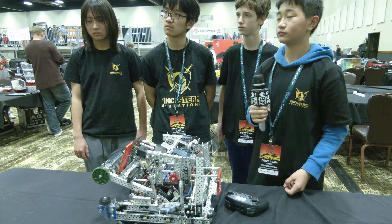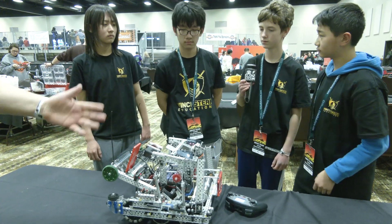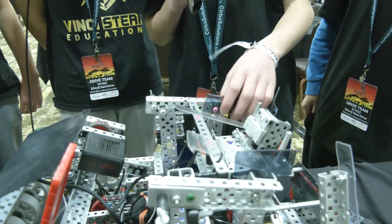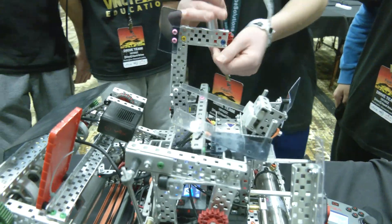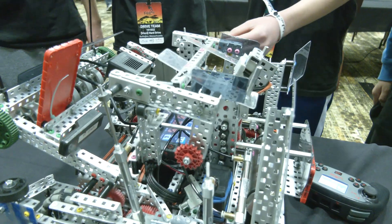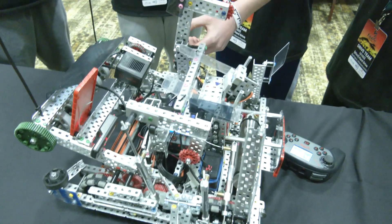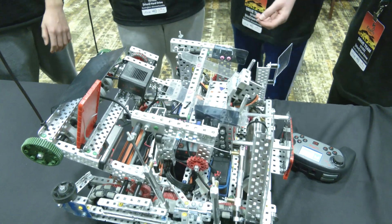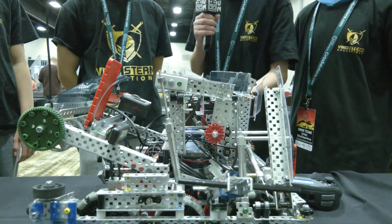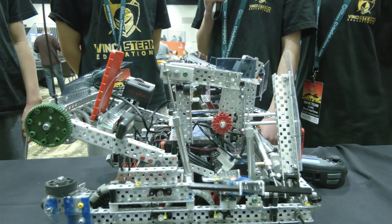One of the things I love about robots is versatility. Daniel, you guys are using a passive climb as well — talk to me more about that system and if we can demo how it works. So we have this passive hang and basically what it does is elevates the robot onto the bar like so. Let's pretend this is the bar. The reason we picked this design is because we didn't have any spare motors, so the only way we could do this is by using pneumatics. This seemed to be a good, convenient, energy-efficient way. So it just goes onto the bar — that's pretty much it.